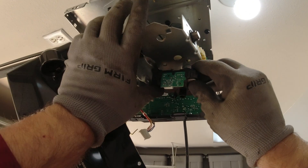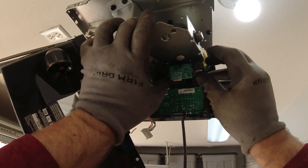From here, snap the new travel module onto the motor bracket. You want to carefully snap those four tabs because if you're not gentle or careful, you could break them, and the travel module won't set properly, creating more problems when you use the garage door opener.